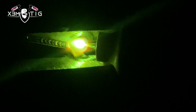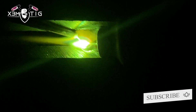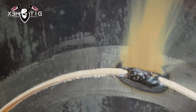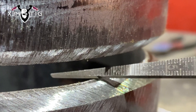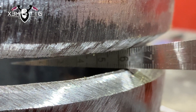I always do top and bottom then connect in the middle, and just stretch that puddle down from the top. It's gonna be three root tacks on this weld. This is the first one — I'm just gonna check for the size. As I said, it's like six and a half mil.